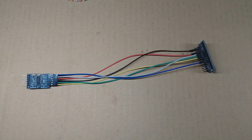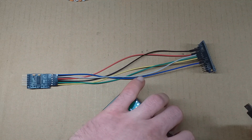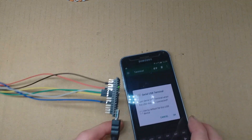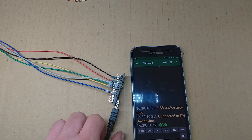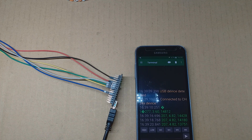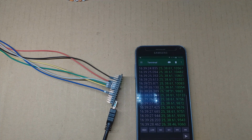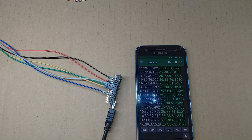Let's connect that up to the phone and see what sample rates we get. I've measured the frequency of the PWM to be 5.3 megahertz, which is around half of the internal oscillator. We're getting around 4.8 samples per second in low mode. Setting it to high gives us around 38 to 39 samples per second. Obviously these UNOs and NANOs are limited to an 8 megahertz PWM signal.